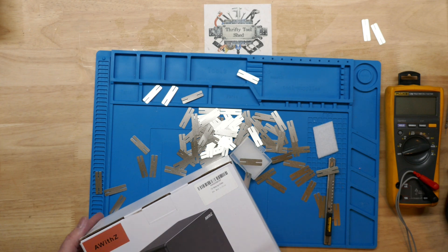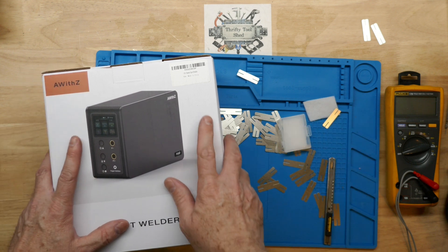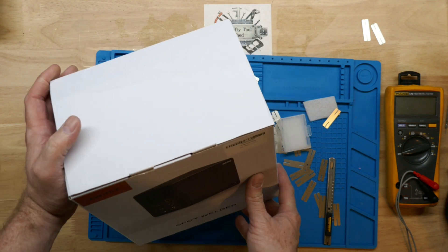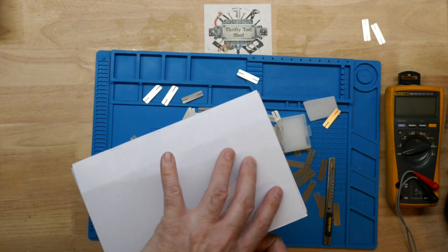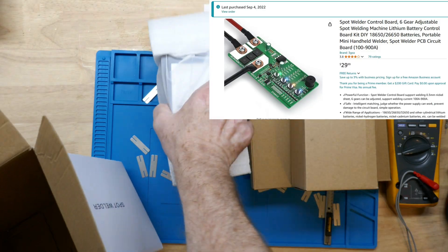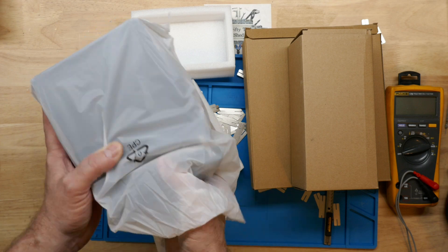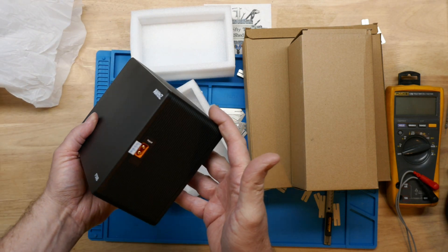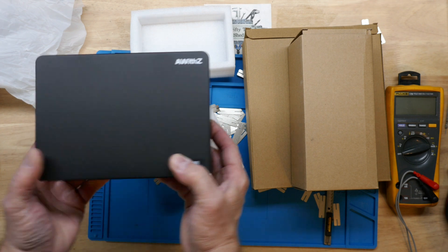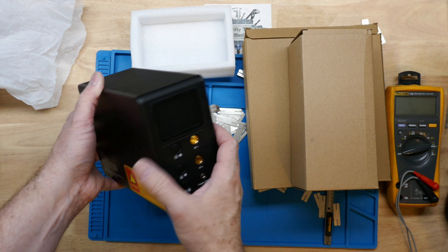Getting back to the spot welder — more than likely the 14kW version is just fine, but I did save up and wanted to go ahead and get the 24kW version. Because with .20 and thicker strips, I have always come up short. The cheap spot welders worked really well for me with .10 and .15, so I got the one I was fairly certain would go over the top. Taking this out of the bag, we see an XT60i — the orange and not the yellow XT60 connector — along with the front display, three buttons, welding lead jacks, and the jack for the foot pedal.